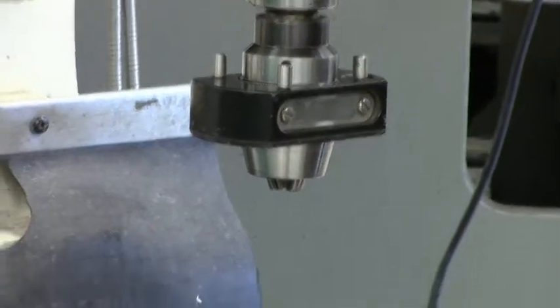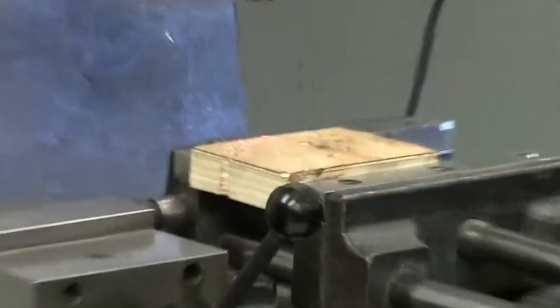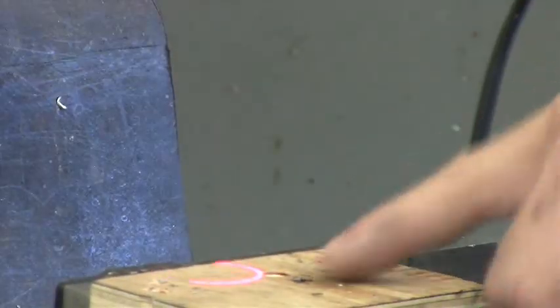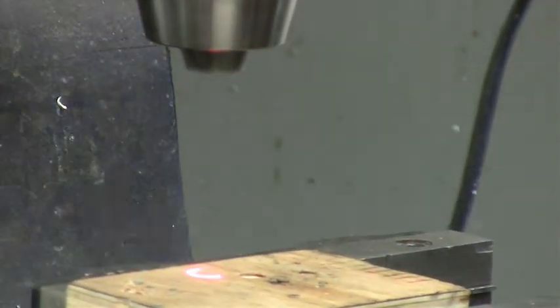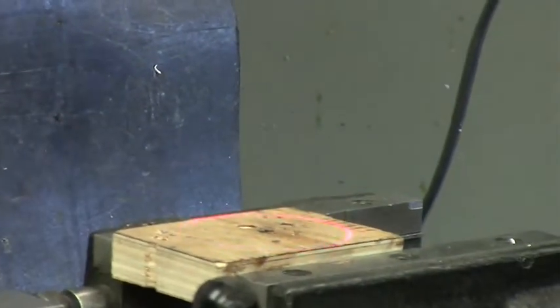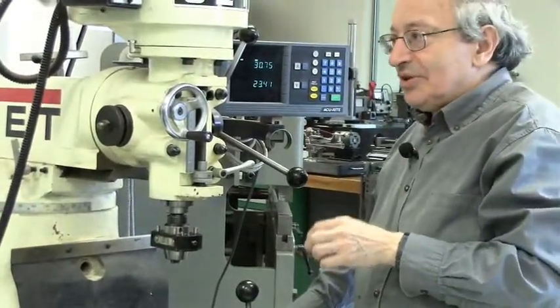This sits like this, and what it does is give you a circle of light. The nice thing about it is that the center of this circle is actually the axis. So if I want to line up the machine with a feature — say I want to drill on this mark — I have this mark here and I want to line it up. It's very easy to line it up.